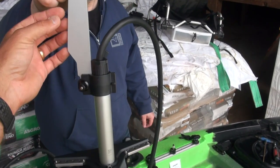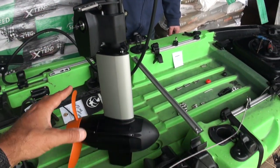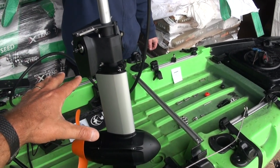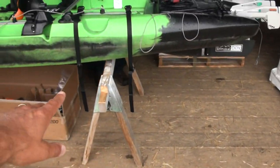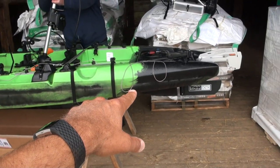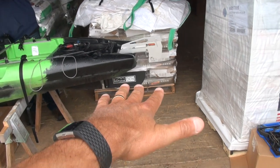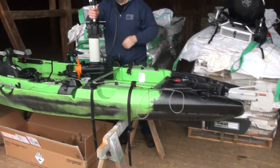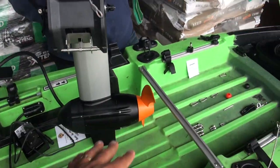You can combine the motor lift arm with the steering triangle if you have a boat that needs the whole propeller set very low, but in this case we've looked at the water line. You can see that mud line there. We followed that back, and we actually stuck my motor on there to look at it, and we've raised it a little bit. I think it's going to be okay with this setup with regard to how deep the motor is.